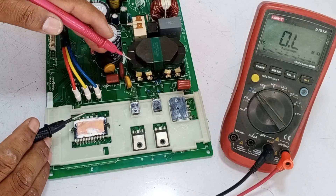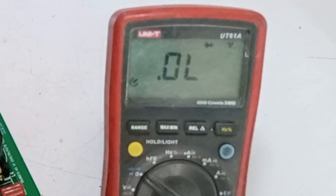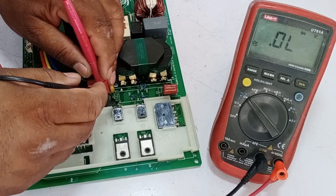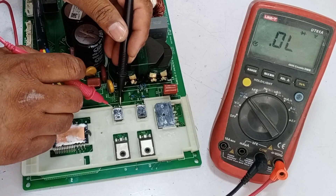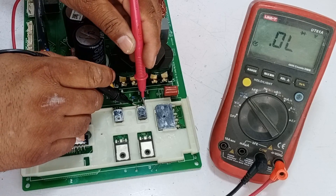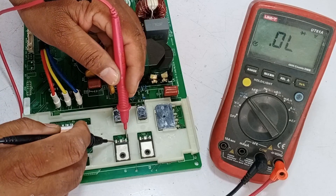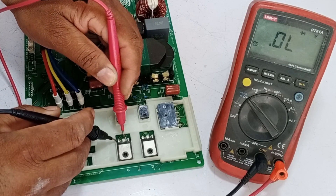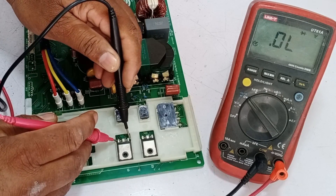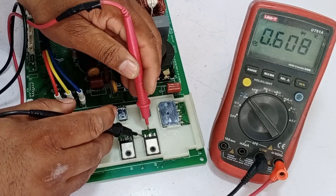I have tested the IPM and it is fine. I will put the multimeter on diode mode and check these diodes. The voltage drop is fine from this side; I will change the sides of the probes — it is fine here as well. The next diode also shows a voltage drop. The IGBTs are also showing okay readings on the multimeter. The value should not be zero on these IGBTs — if it shows zero reading between any pins, it means those pins are short-circuited. These IGBTs are fine.